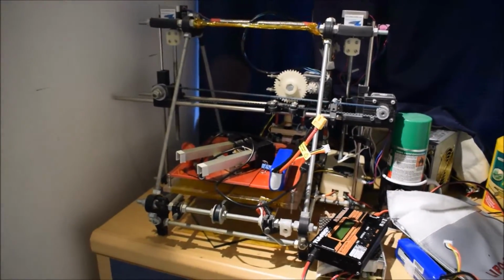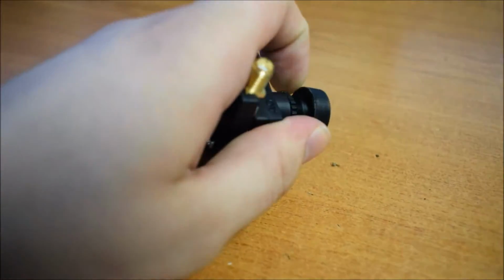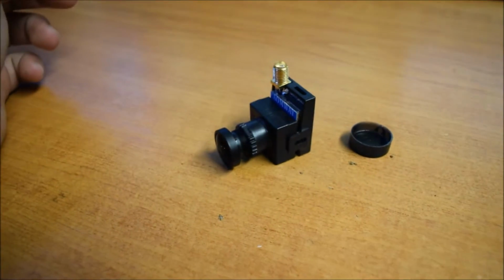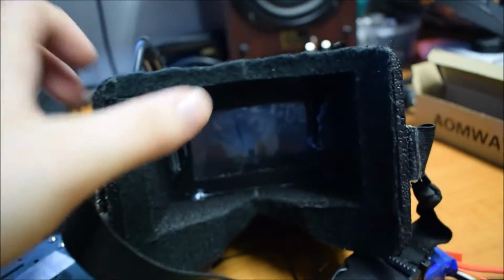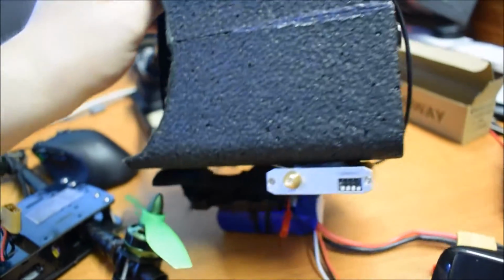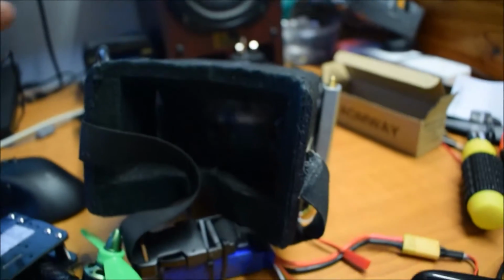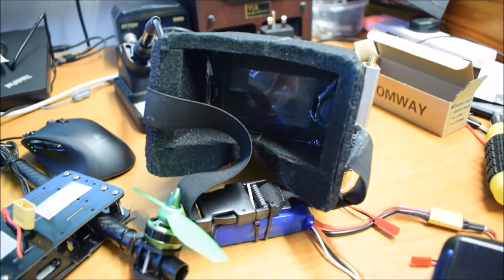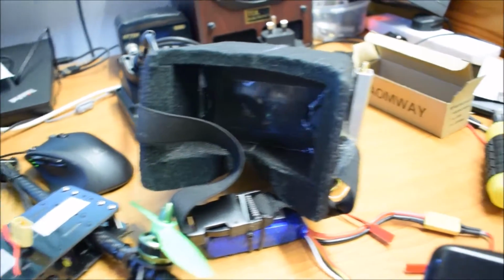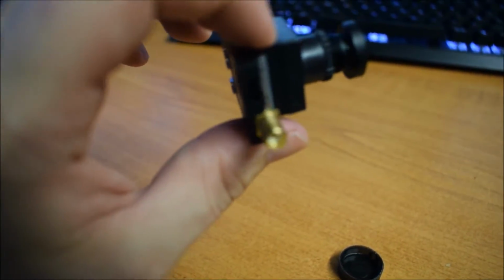And we've got the printer in the corner over here which is turned into a storage shelf for batteries and things. So, one of the other nice things that I've ordered for this is this tiny little FPV camera. Just pop the lens cap off. So on the hexacopter, I've got FPV currently hooked up to the thermal imaging camera, which goes through to these homemade glasses, which are a bit bulky and horrible. I really want to get some Fat Sharks if I splash out the cash. But it's a car reversing camera, a LiPo receiver, and a little foam box that I'll put a link to in the description. So that's quite a cheap solution, really. A decent pair of Fat Sharks, I think the cheapest you can get are 200 quid, and this must have been 30 quid, something like that. But anyway, this little camera's quite cool because look at the size of it, and it's got a built-in transmitter. Fantastic, and the correct polarity of SMA connector, thank God.